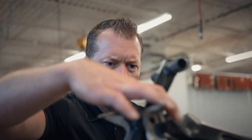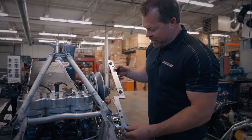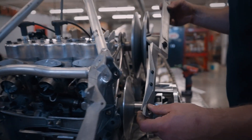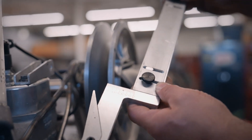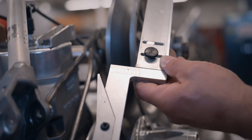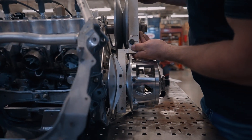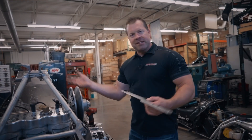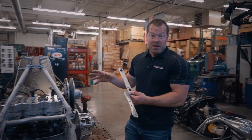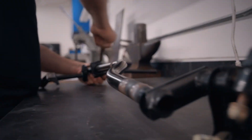We've got the clutches roughly aligned, very close, with some shimming still to do. We've got a straight-line custom offset tool that's actually adjustable — we've got some numbers in here, and on both sides you can set it to the offset you need. When this is all done, which will be really nice for the customer, when he takes it apart we'll be able to set this offset — say you're at 35 millimeter offset — so next time he takes it apart and puts it back together, he can put the tool in there and self-align it himself.